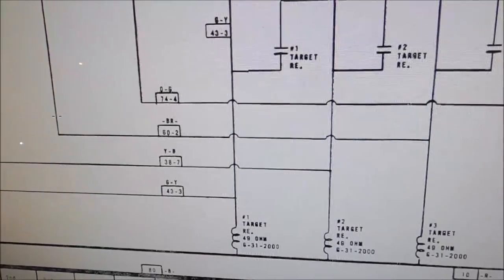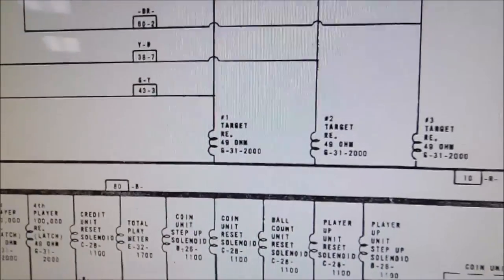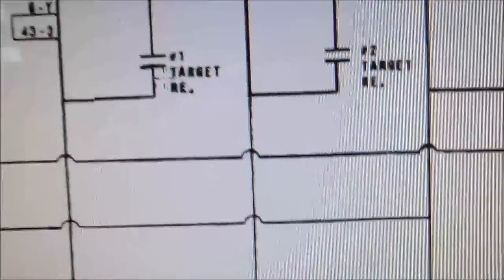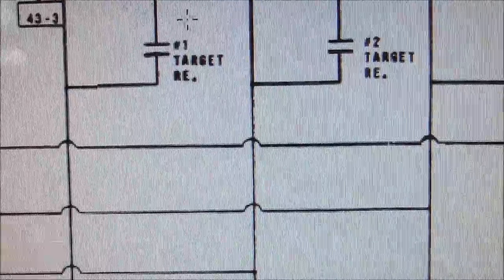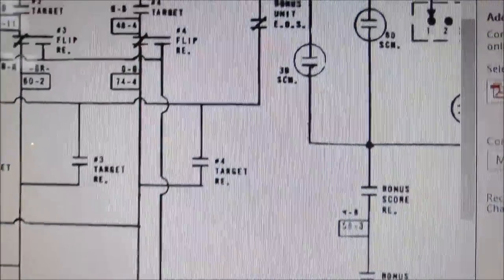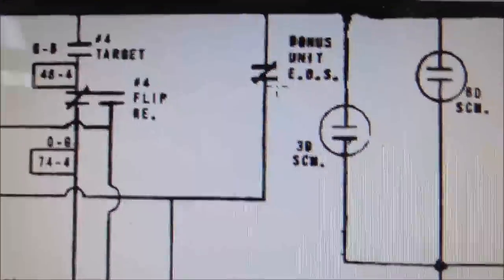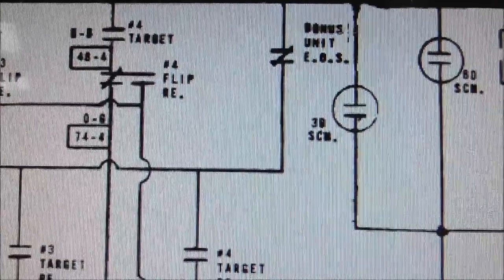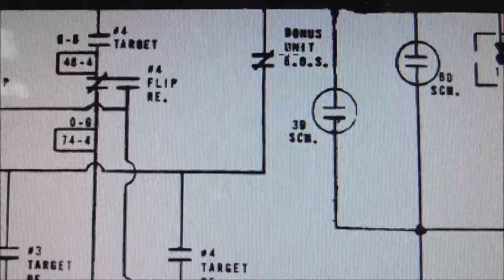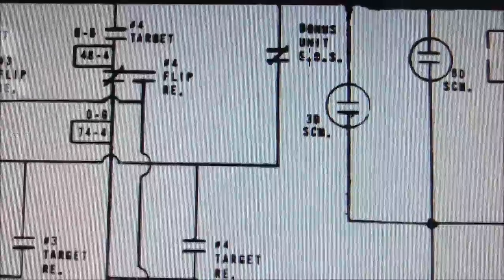Okay. So when it hits the number one target relay, I'm trying to figure out the best way to explain this. When the relay pulls in, this switch connects, because it's on the number one target relay that just came in, which connects power through the bonus unit end of stroke switch. So basically, it is eventually going to pull in the bonus unit because you get 1,000 points every time you flip the flip, right? So once this bonus unit pulls in, it hits another switch on the bonus unit that